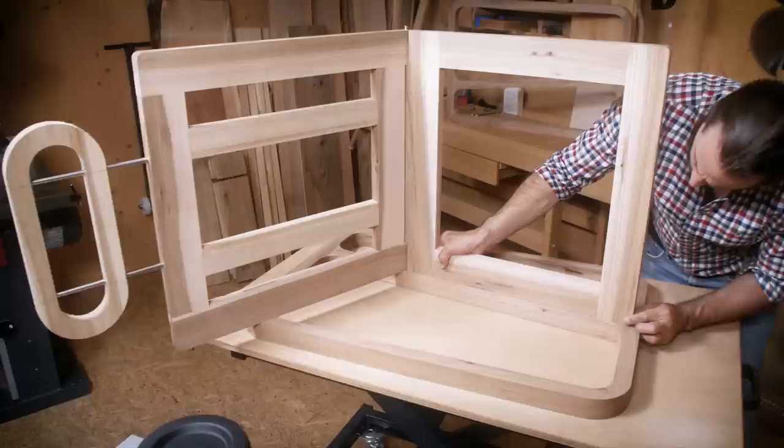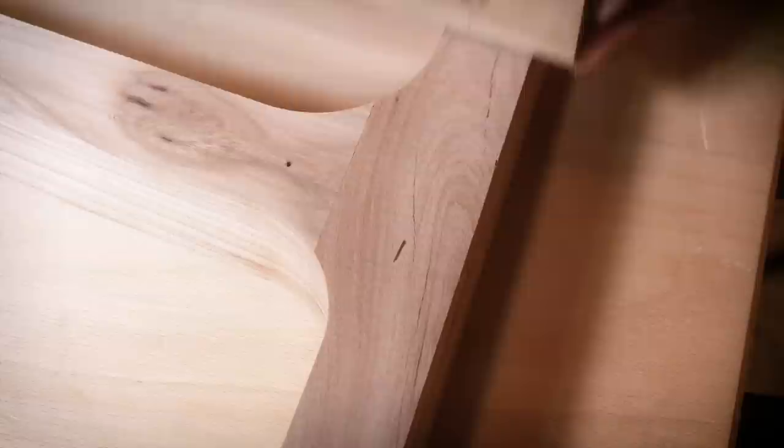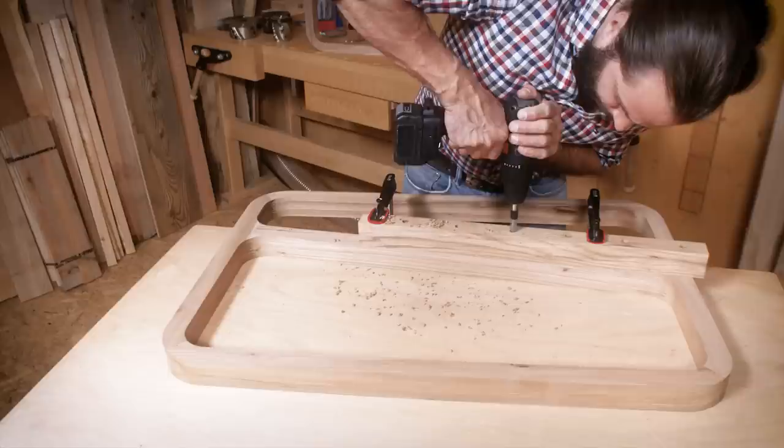For the side pieces, only the first dowel needs to be marked. The template indicates the subsequent holes. The template height acts as a guide to ensure that all holes are bored straight. A piece of tape marks the boring depth.